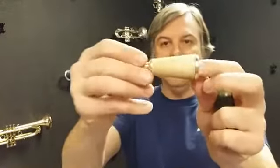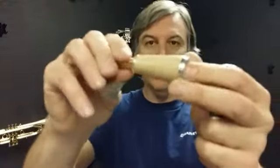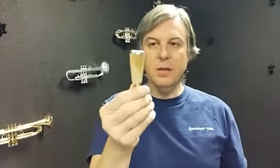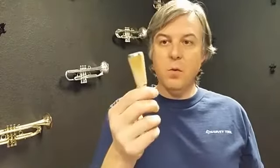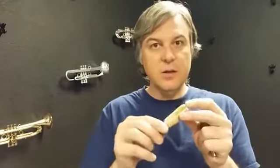This is pure maple, unstabilized. That's a pretty mouthpiece as well. But in my experiments, I learned that I made some unstabilized versions and I'm not going to make any more after this, because — at least out of maple — it was very difficult to keep the threads from chipping out as they were machined. So the inside where the rim and cup are, there are some chips where the threads are. The rims still thread in but they're kind of tight, and the backbore and the nut still thread in but they're kind of tight as well. Because they are unstabilized and have those issues, we're going to let these go for $50 each, just to let you guys have fun with them. Then maybe in a month or so, I will reintroduce them as a stabilized version, which is an extra step and will probably cost at least double that.